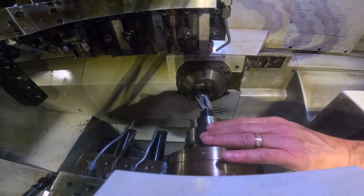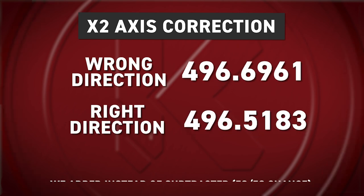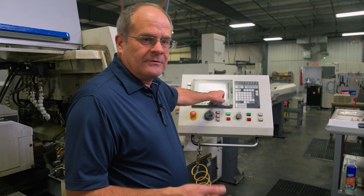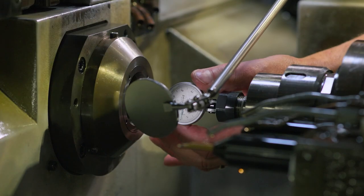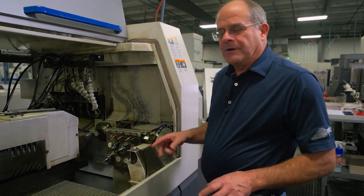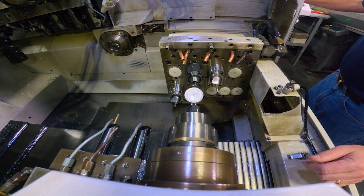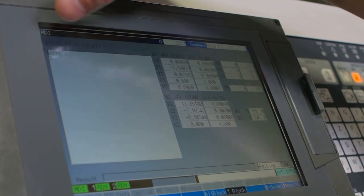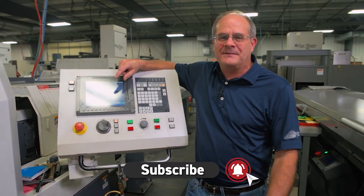Jogging forward, we can see we went the wrong way — we're now double what we were before. When I adjusted the absolute position parameter I added the grid shift amount when I should have subtracted it. I went back in, reversed the calculation — took my picture of the original grid shift, subtracted what I needed from that, entered it, and checked it. Now we're right on. For the rest of the alignment stations we won't need any more grid shifts — the grid shift we just did for T3000 is set, and the other adjustments are made to what we call the hidden page via a G891 command in MDI. That's the end of part two — be sure to like and subscribe and stay tuned for the next one.